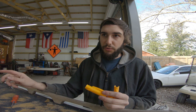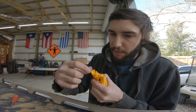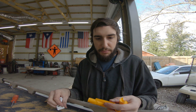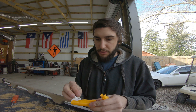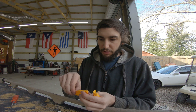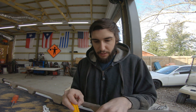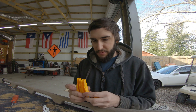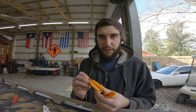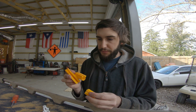It has a pretty good guide here to funnel the slug into the mast gate where it needs to be so that it doesn't pop out. That also centralizes the little wings on the tip so it doesn't pop out the way I was seeing before when I was sliding the slug through. Something like this piece takes a little over an hour to print in fine mode. You can print it coarse and it comes out rough — just good enough to see if it's going to work. These three pieces took a little over two and a half hours to print.